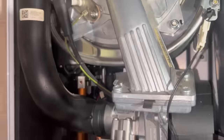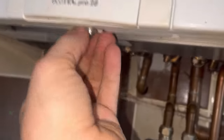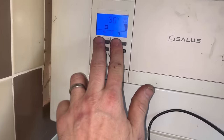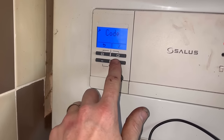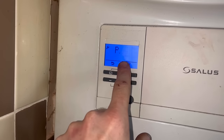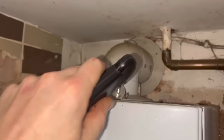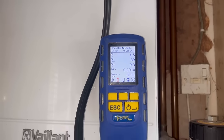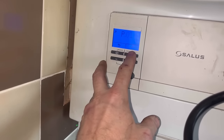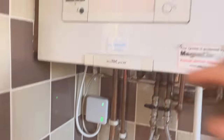The repair is done, but we've got to do our CP26.9 checks now because we've taken the case off. Another common fault on these is the diverter leaks — we did check that; the rustling inside is from a previous repair on the diverter, already been done. Get the case back on and do the flue analyser check. For service mode: press the top two buttons, press the play icon, enter code 17, press play again, then use the top right button to get to P01 (maximum) and P02 (minimum). Check both readings to make sure the board is working safely. Always put a sticker on the boiler so they know who to call next time.